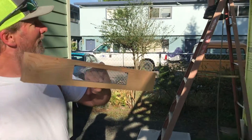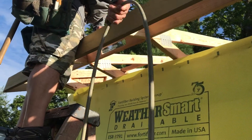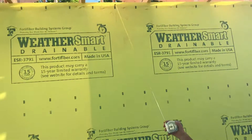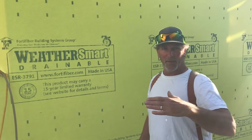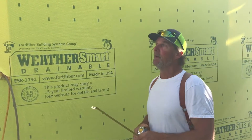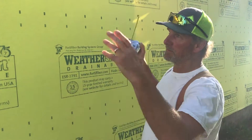Dave's up there nailing. He nailed the solid ones in yesterday; today he's nailing in the vented blocks. The reason these blocks are way out here is we're going to run a flat piece of soffit material, and then right here you're going to see that upside-down LP paneling — it's visible from the bottom and it looks good. That's why we're going to put it upside down, and that will be the beginning of our roof sheet. We'll put the rest of the roof sheets and stack them on, right to those, and just go like the wind.